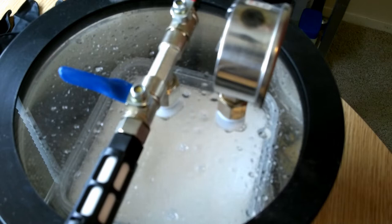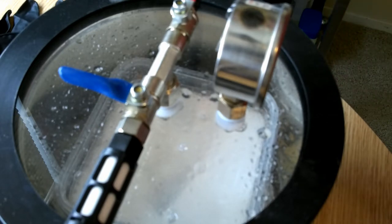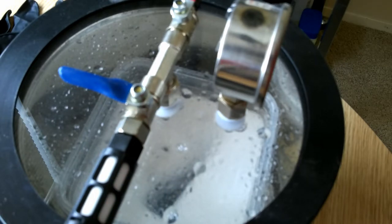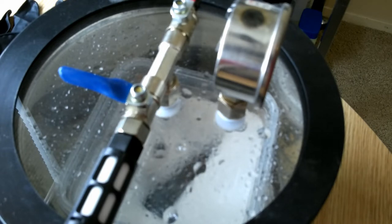And it's just a process of turning up the vacuum because it's sucking all that air out of the wood and replacing it with this cactus juice. So the end result will be that the wood will be completely inundated with the resin, the cactus juice resin, and completely stabilized. It'll be harder than ironwood when it's done, you know, really hard wood.